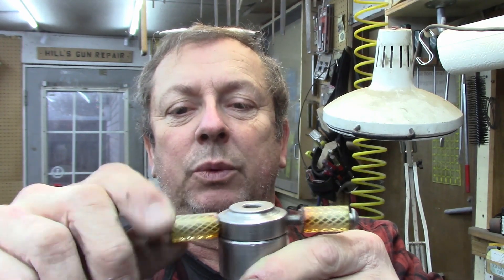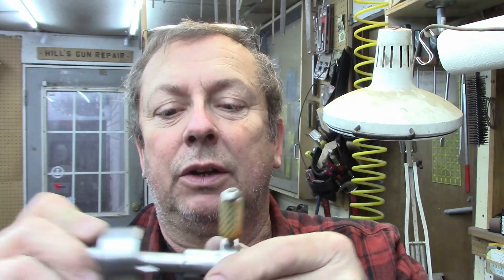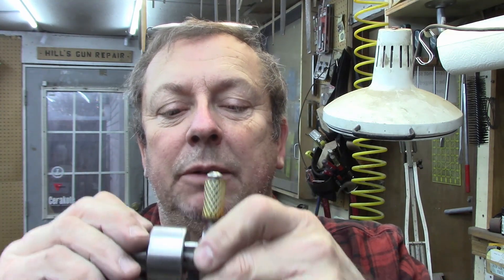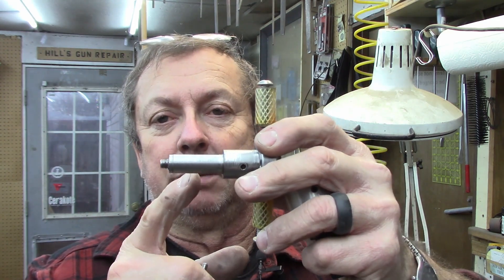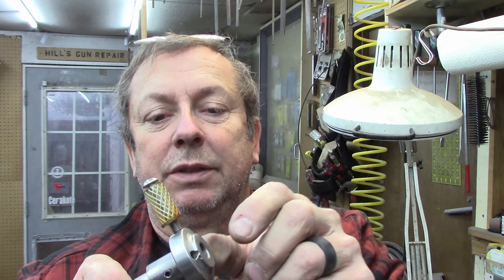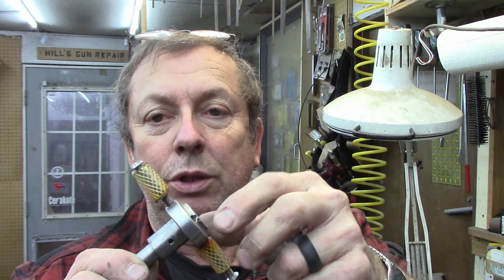All they are is a quarter-inch button head cap screw that's got a piece of hose over them, so when they're on, they screw up like that. After it's fed on there, you can use that to start backing it out until you can engage the drive dog again. I've got this disassembled now because I wanted the dimensions off of it. The bodies themselves are the same for both of them.